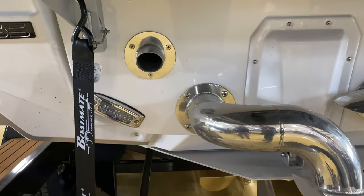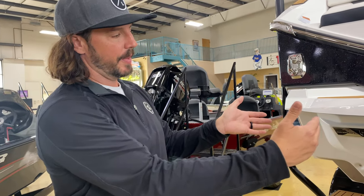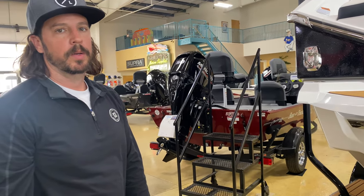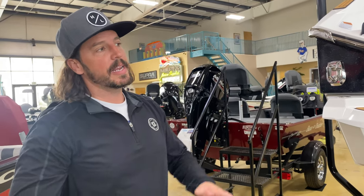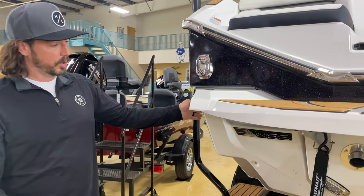There are some pretty bright LEDs on the back underwater lights. The NCRS — the Nautique Configurable Running System — is a plate that's built into the hull, not added on like other manufacturers do. That plate is configured into the whole design and helps the boat get up to plane. It stair-steps: as you take off it goes down so the boat can get going, then moves up, then back down, up, and back down, helping the boat work its way up to the surface. On stock settings, someone can go in and select a wave profile and get a pretty decent wave, because those settings tie together the center plate, surf plate, and ballast.